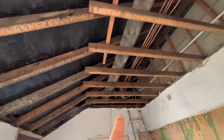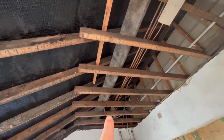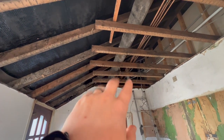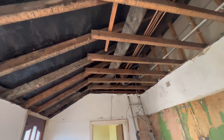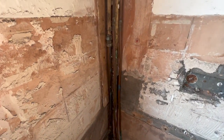And then I'm gonna have to turn the water off at some point and also cap off the hot and cold feeds over here. Realistically, I wanna cap them off as far back as I can to stop any possible Legionella. But it should be okay for now. So that's the plan. Let's go and do this, and we'll see how we get on.